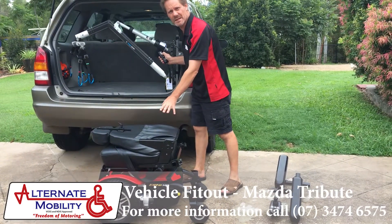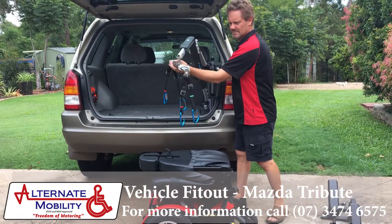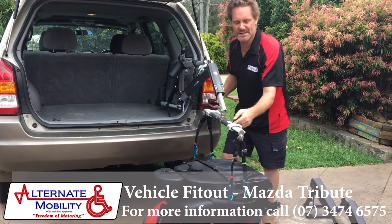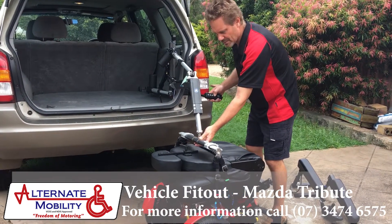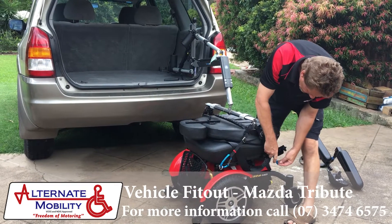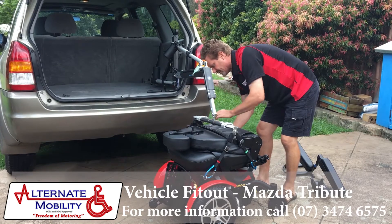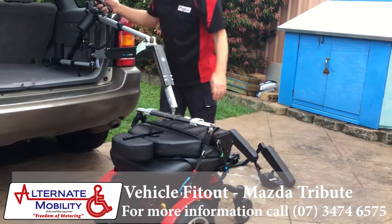Then we'll rotate the lifting arm out. A good idea is to have the wheelchair gears in neutral — that way they can be moved into position. This is a four-point lifting harness, and for scooters and other items they have just a simple two-strap arrangement. We lower the post all the way down. We've set this up so the red clip goes on the front and the green on the rear, so it's easy to use. Remember, they're positioned slightly differently so that the balance of the chair will accommodate that. With all of these things in place, footrest up, we'll now raise the hoist.